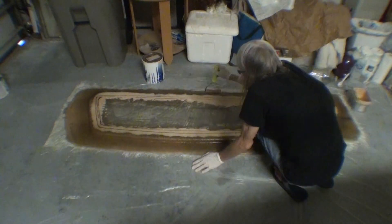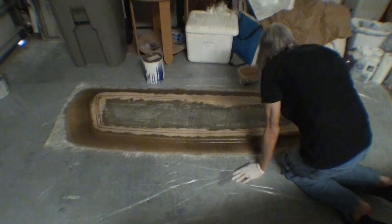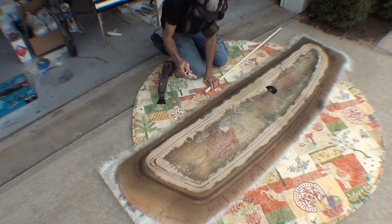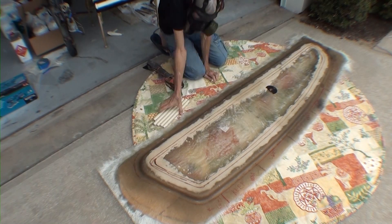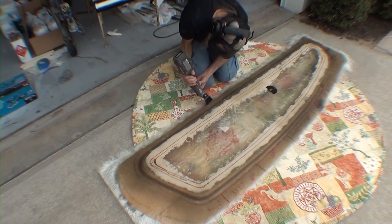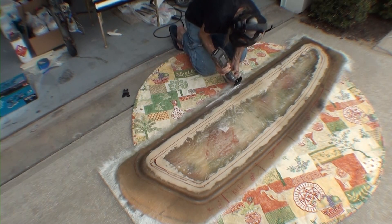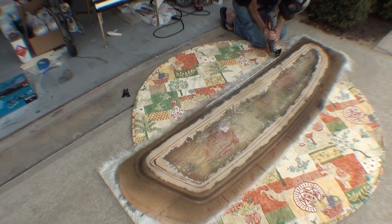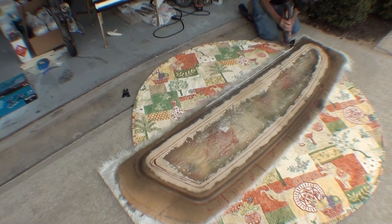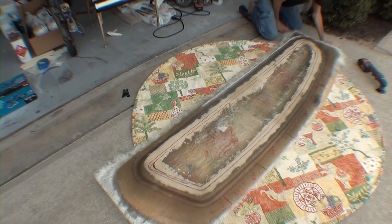This is the plastic I got to make the hinge — it's plastic water pipe. I got the smallest kind they have, and then a kind that's a little bit bigger that the small piece will fit inside of. So the small piece can be the hinge pin and the bigger piece can be the parts of the hinge on the outside.